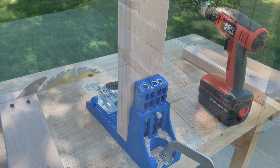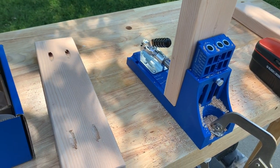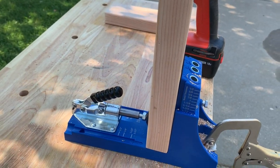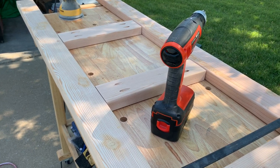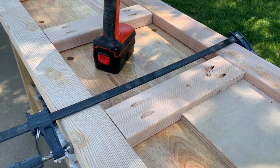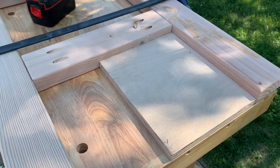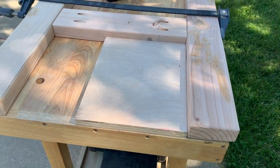Because we're doing pocket holes in 2x4 stock, I used the outside two holes of the pocket hole jig. It was pretty easy and took very little time to drop the pocket holes in. Then I laid out the ladder and used a piece of three-quarter-inch plywood as my spacer, so looking at the bottom of the ladder, all of the rungs are evenly spaced. I opted not to glue the rungs and just use the pocket holes — four two-and-a-half-inch pocket holes are more than strong enough to hold even my weight.